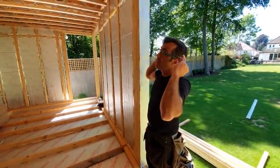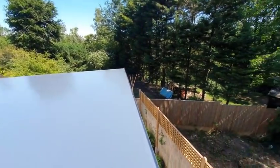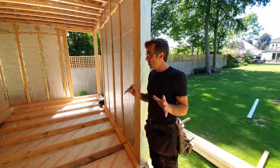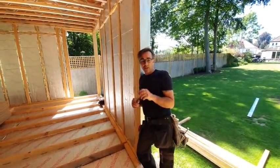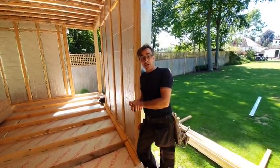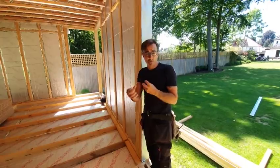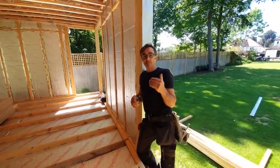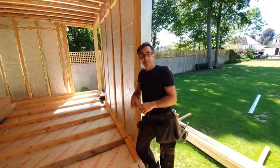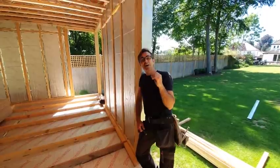That concludes the erection of the timber panels - the timber frame. We've got our roof on, it's looking lovely up there. The next job is going to be putting down 22mm P5 Egger Protect flooring - that's a flooring I use a hell of a lot. In that video I'm going to show you the actual method as set out by the manufacturer. There are a couple of methods of fixing - we're going to choose the particular method that's most recognised by the NHBC, especially if you want a product guarantee and a warranty. Thanks for watching - check back soon. I really enjoy having you watching these videos.